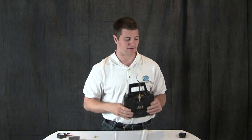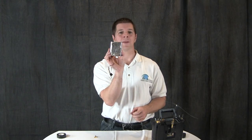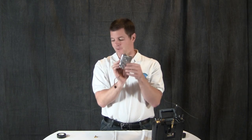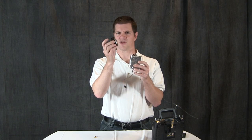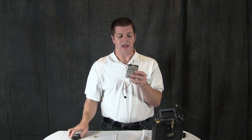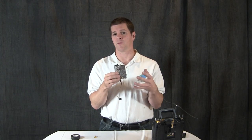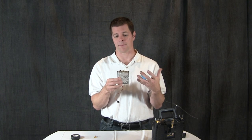For that, you need to shield the case, and the cheapest, easiest way to do that is simply to wrap it in something metallic. First, wrap your LRS in some kind of insulator such as electrical tape — even packing tape works — and then wrap it in either aluminum foil or a continuous piece of aluminum or copper ductwork tape.